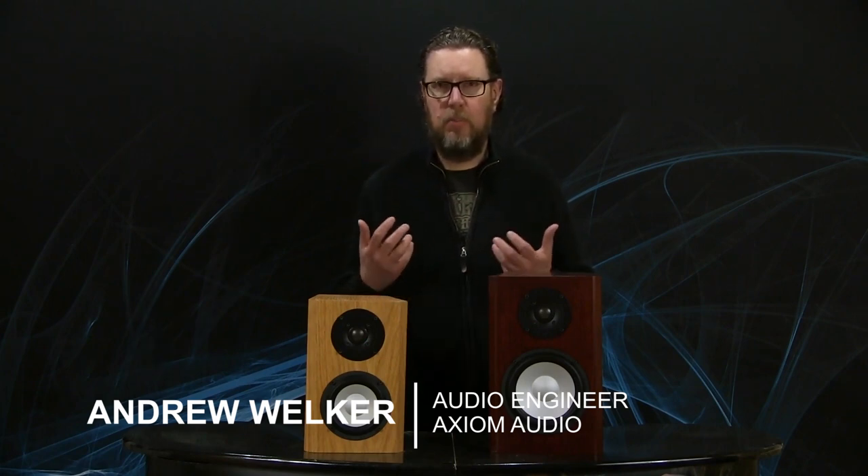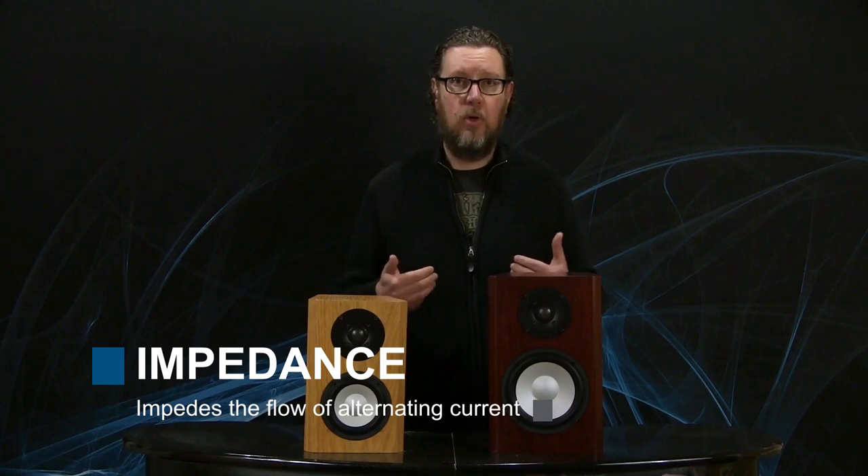I'm not really sure what it is, but it seems that grasping the topic of loudspeaker impedance or nominal impedance — or resistance, even though resistance is not the right term for a loudspeaker load — stirs up confusion anytime I've made a video. There have been some recent videos about loudspeaker impedance and understanding why a lower impedance like 4 ohms is harder on a power amplifier or receiver than an 8 ohm nominal loudspeaker.